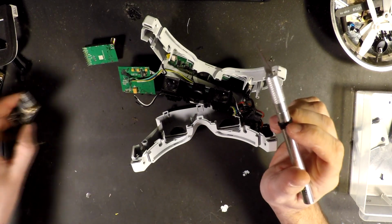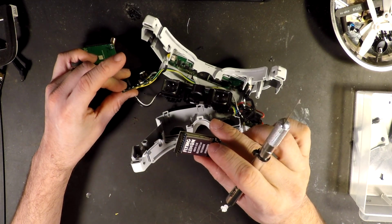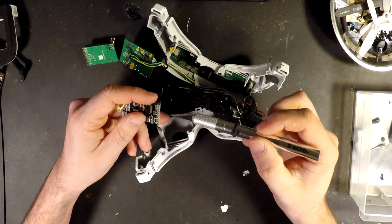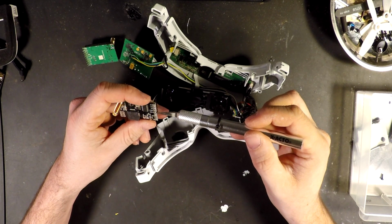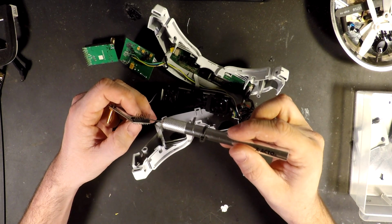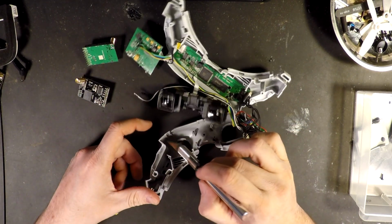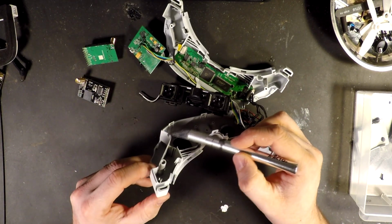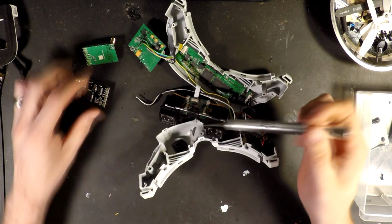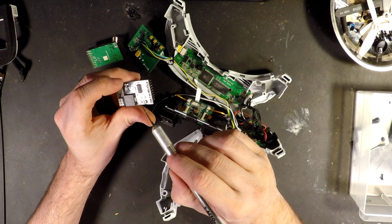All right, so whenever we do this now, the module that I'm going to have plugged into the primary slot, the one that actually plugs inside the goggles, I've got to go in and remove the video pin. So the video out pin right here, I'm actually going to cut that off. We're not going to use that. If you look down here, I've got two wires that I had cut a little tiny divot, a little slot out, had those two wires running through this slot. One will be soldered onto the video, and one will be soldered onto RSSI.